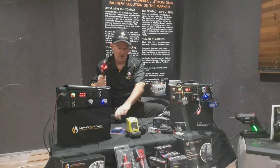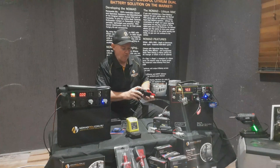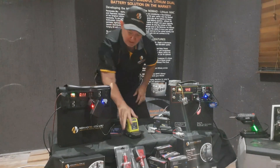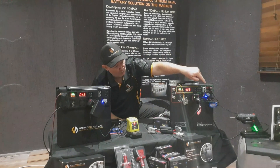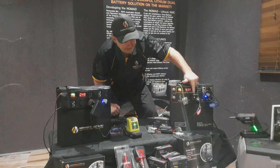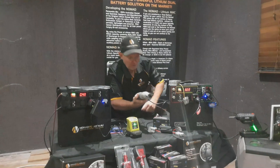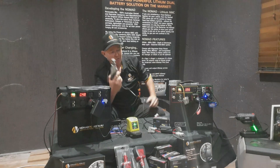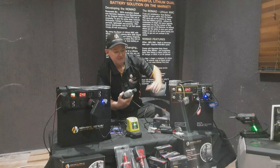You can then charge it at 8 amps from your AC-DC charger — this pulls 109 watts, and the inverter is 150 watts. To give you an idea what you can run on 150 watts: laptop chargers are about 70 to 90 watts. I run my Ryobi 18V packs — this will pull about 6 amps when it's empty. I've got a drill set up here. I run a couple of inverters but I don't draw more than 10 amps from each socket. I've also got the fridge plugged in right now — no problem, because I have 20 amp maximum output.